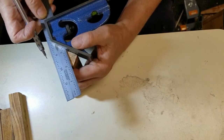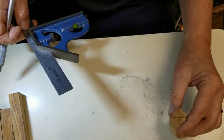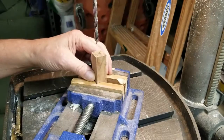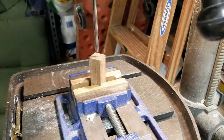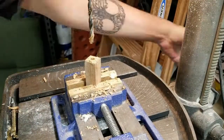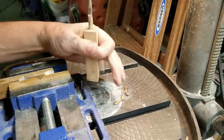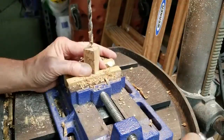Mark out the center and do that on all the pieces. Drill it out with the appropriately sized drill bit — seven millimeter, I believe — but the kit comes with instructions, so you just do whatever it says. These blanks are a little bit longer than the throw of my drill press, so I've got to manually get that last little bit. If you do this, make sure — extra sure — that your hand is not on the bottom of the blank. Then proceed to drill out all four of them.